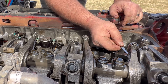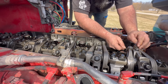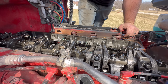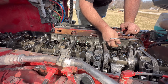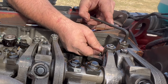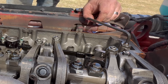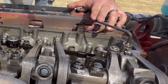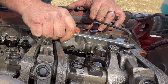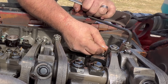This is our exhaust and again it won't even fit - we are tight. What I like to do is kind of get that oil out of there and then zip it down. This is what you're looking for: light drag. What I mean by light drag - tighten this so it starts to kind of... see, now it won't move. That's light drag right there, I'm good with that. Now you want to hold it and tighten your jam nut, then verify we're still good.